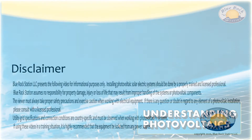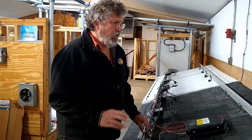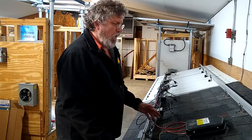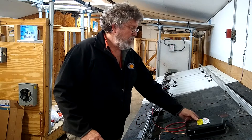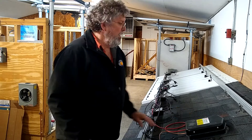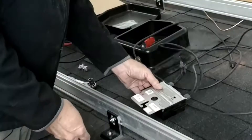Welcome to the magical world of solar. My name is Jay Warmke. In this lab we're going to install SolarEdge power optimizers on a Unirack system. The Unirack railing system is a commercial system — there are a lot of other ones, I particularly like Iron Ridge — but with this particular system we will be mounting six optimizers, then a solar deck combiner box used here as a junction box with a nice low profile so it stays below the panels and flashes out very nicely. Then we'll put our panels onto the system so you can see how those get mounted as well.